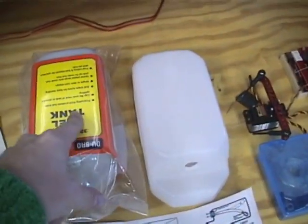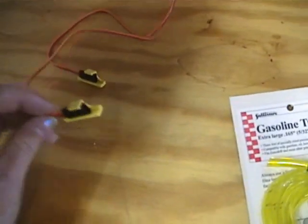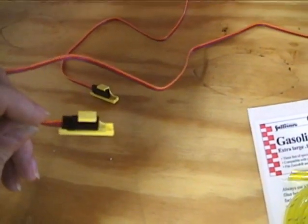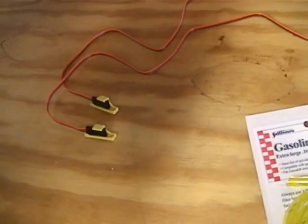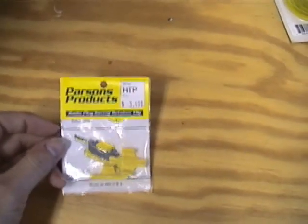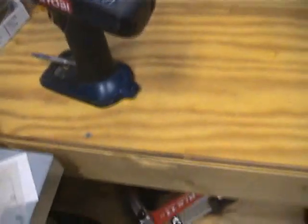You've got to have one for fuel and one for smoke oil. I've got my extensions laid out where the elevators and wings come on. I like using these little yellow servo clips. They're easy enough to take on and off if you have to take the plane apart a lot or do maintenance. It's not as permanent as the heat shrink. These clips are made by Parsons Products and you can get them for Hitek, Futaba, and JR servos. They're a handy thing to have around.